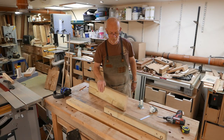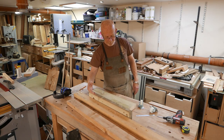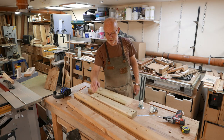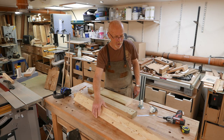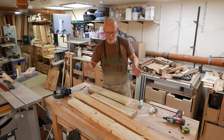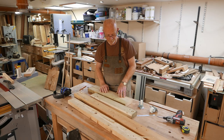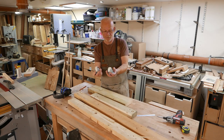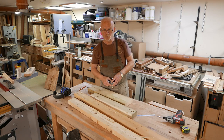So onto that support leg. I've dug out of my woodshed some old scraps of 4x2 and a bit of 6x2. I'm going to size them all down on the planer and through the thicknesser and see what I can salvage. Hopefully I've got enough here so that I can make a very basic frame with a cross brace, similar to half of a stable door. And then I'm going to pop some lockable nylon wheels on the bottom and we'll be there.